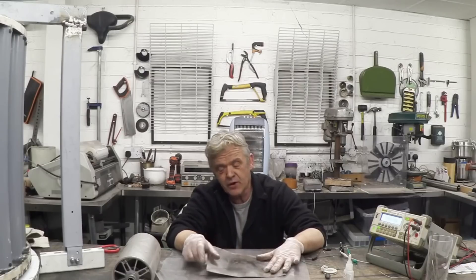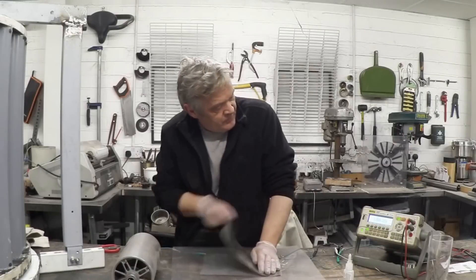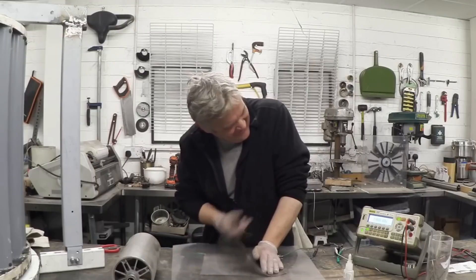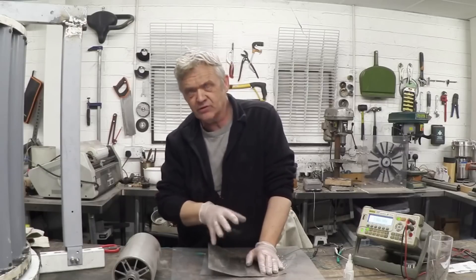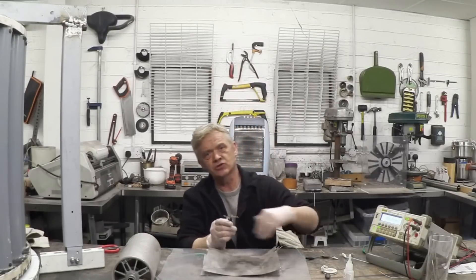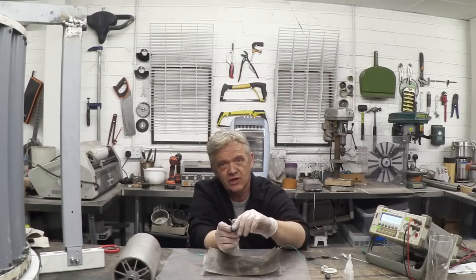When I connect the other side of that capacitor to the other AC side of our circuit, we have a variable capacitor. I vary the capacitance by either changing the area of the plate or moving the distance between the two. If I take that and lift it up, I've created a variable capacitor. The rate at which the charge increases is proportional to the rate at which I'm moving it. What I'm doing is pumping electrons through the circuit and they're getting trapped in the storage capacitor.